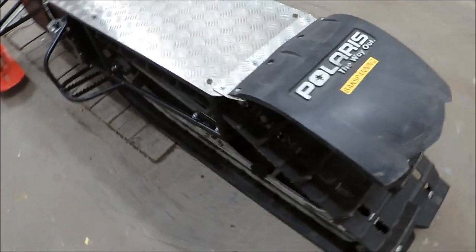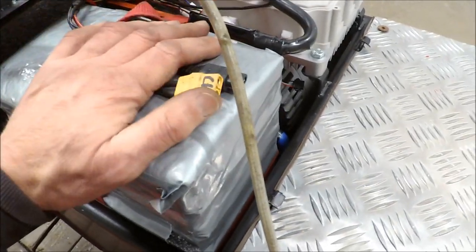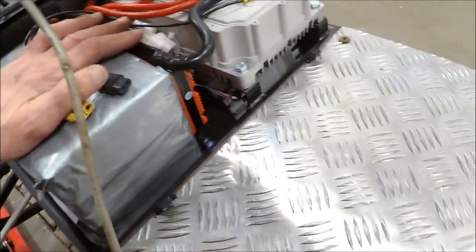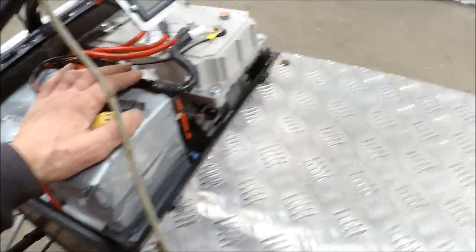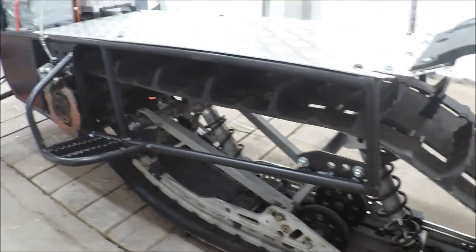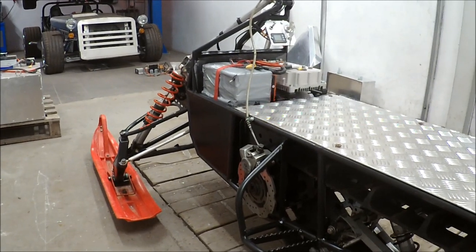There's some protection from snow. Here you can see the braking system — also from a snowmobile. Here are the wires and where I charge the main battery and auxiliary battery, so I can just remove the hood and charge it. I even plan to put in some heating here if I want to drive and charge it outside. The skid is rebuilt — as light as possible. It's 44mm height. The frame is tubular and the front end is from a Summit. Here is the chain case in position and the hood.